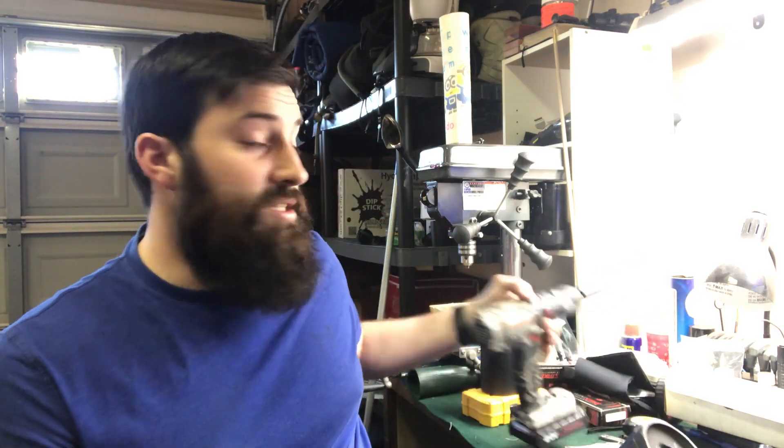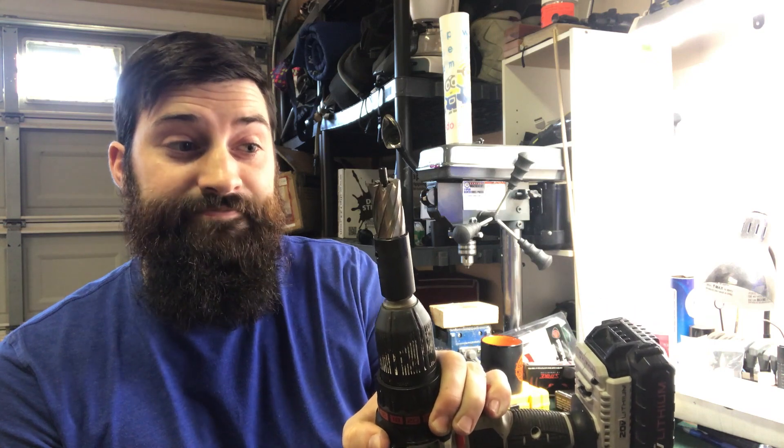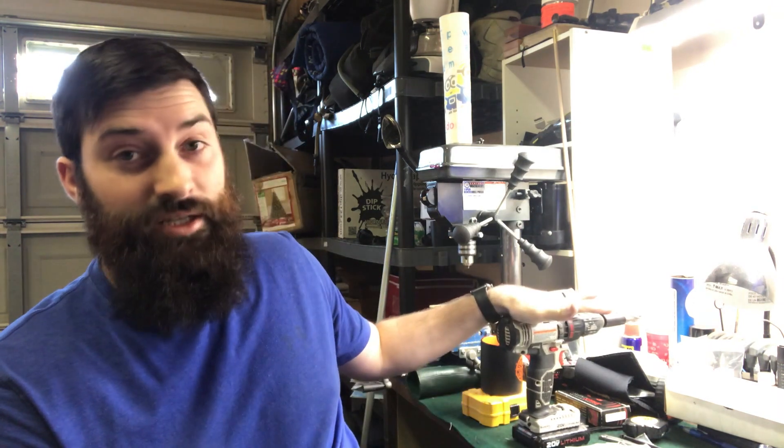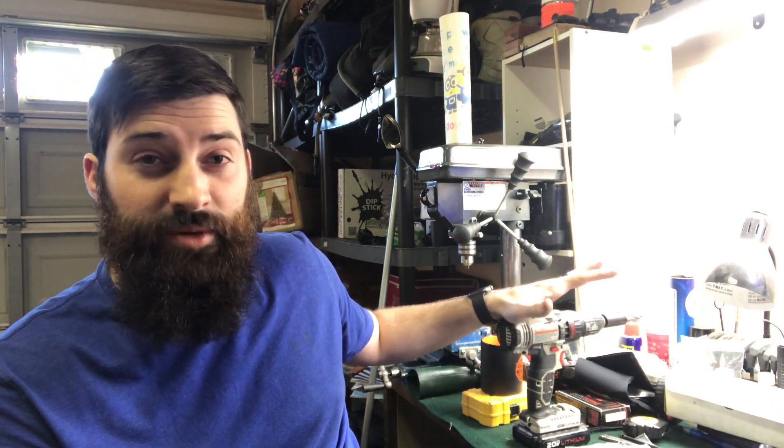So there you go. If you need to cut down a barrel and you want to thread it, I highly recommend getting these bore-guide tools, even though they're about $75. Especially if you're ever thinking about suppressing whatever you're cutting down, you definitely want a true-to-bore thread pitch. If it's not true-to-bore, you're going to blow up expensive stuff and be so mad you didn't spend $75. Please subscribe - it's going to help me out, and I'll continue to do this anyway because every time I sit down to work on guns I turn on the camera. Y'all be good, be safe, we'll see you in the next video.